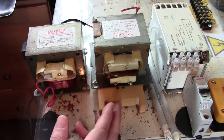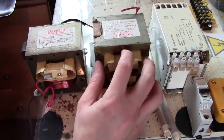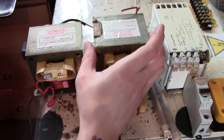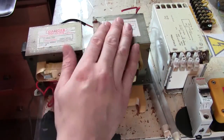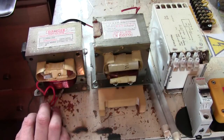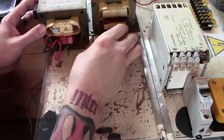And there's more than one reason for that. I will go more into depth, and that is about the insulation of the actual winding on the transformer closer to the core isn't as strong as the insulation on the outside, okay, which is why when you join two MOTs or two transformers, it needs to be done properly and safely. So that's something else I'm going to be covering.